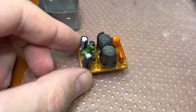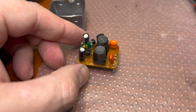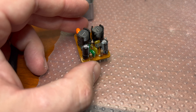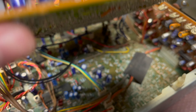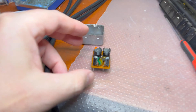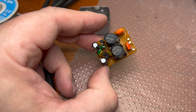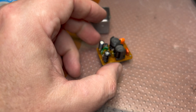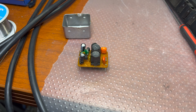That's a lot of components for just a bias generator: two coils, two orange capacitors, two regular capacitors, and two more sitting outside, plus lots of small capacitors and transistors. I'll replace four capacitors and let's see if it will start working.